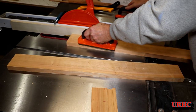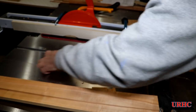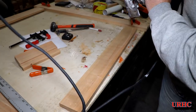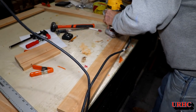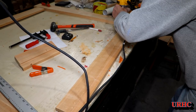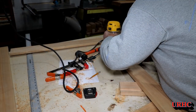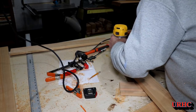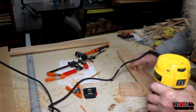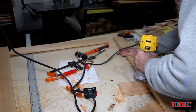I just slid the fence over to do two cuts and get an inch and a half. I really like those little push blocks from Rockler with the soft rubber bottoms — they add a lot of safety. Then I threw a chamfer bit in my little DeWalt compact router to break some of the edges to match the chamfer on the actual tongue-and-groove V-groove stuff on the side.